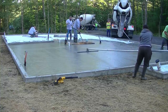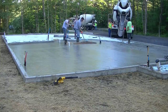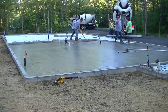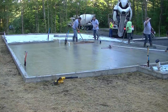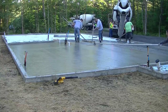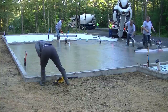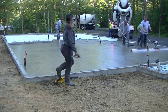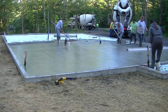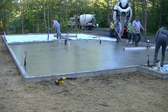With the stand-up screed I don't have to bend over and kick my feet — I can just pull the concrete towards me, fill my feet in as needed, and fill in behind the screed as needed. Luke is over there getting ready to use the Screed Demon to come down the bay while I'm hand screeding that middle piece by all those pipes.